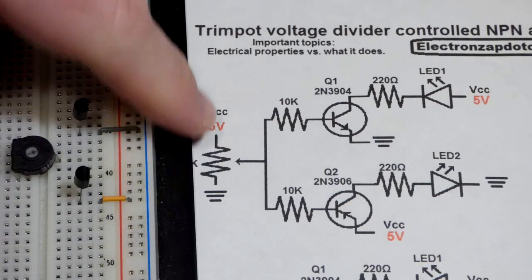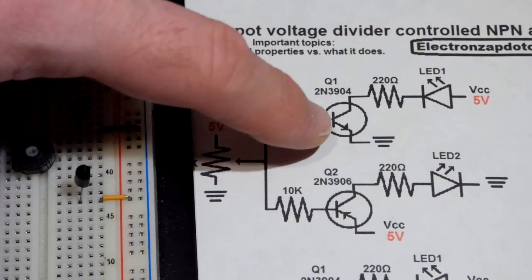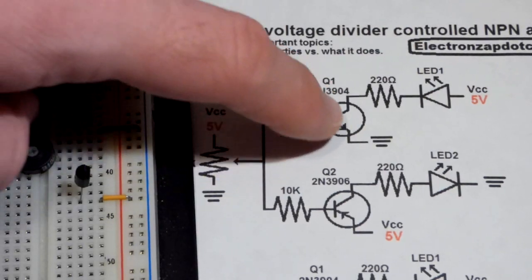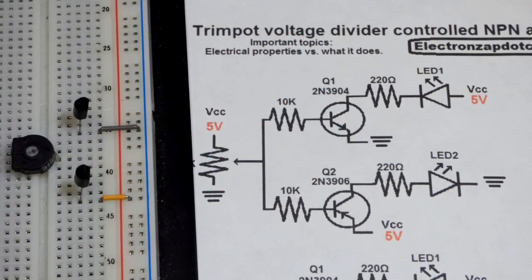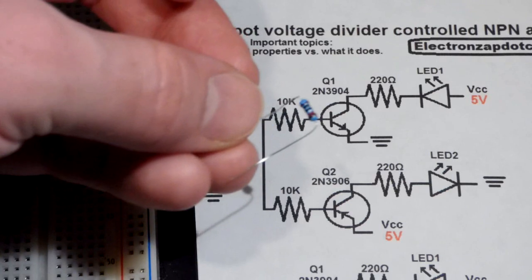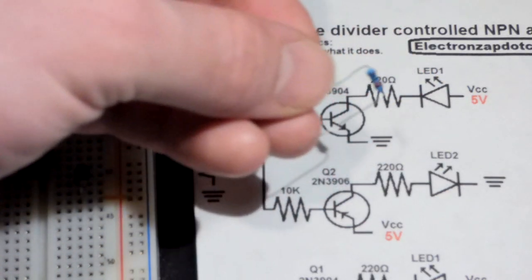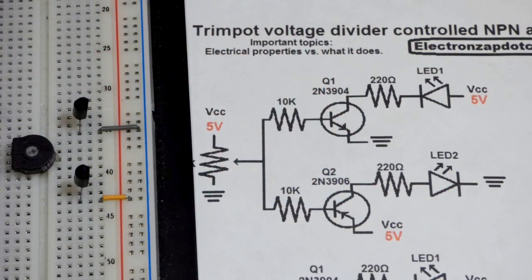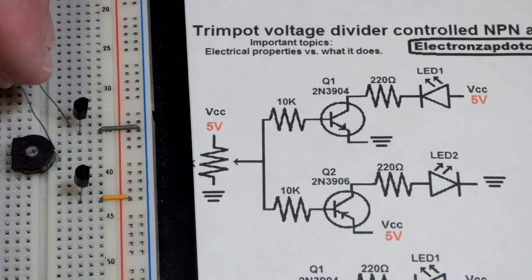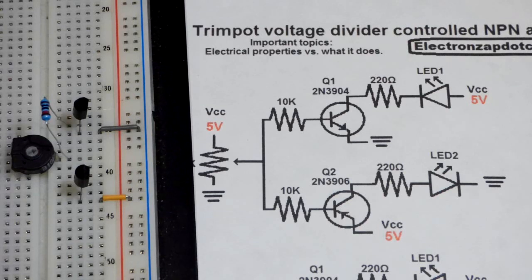Now let's look at these two resistors. The trim pot can go all the way to the 5 volt rail or all the way to ground. If it goes all the way to 5 volts, we would have a direct current path to the base of the transistor without a resistor, and the only thing limiting current would be the diode drop — practically no resistance — so we'd get the full current the power supply can provide until it burns out. We don't want that, so we use a 10 kilohm resistor. A fairly high value like 10 kilohms works because the transistor will still saturate — that small amount of current is still enough to get the transistor to fully conduct. Then we put that to the middle pin of the transistor and to the output of the trim pot, and do the same with the other 10 kilohm resistor for the PNP transistor.